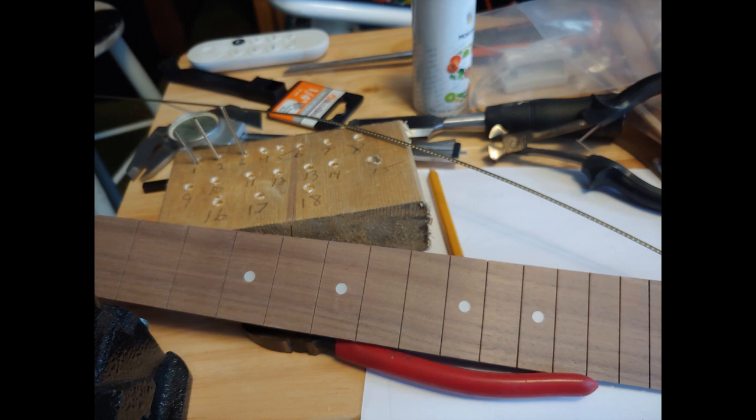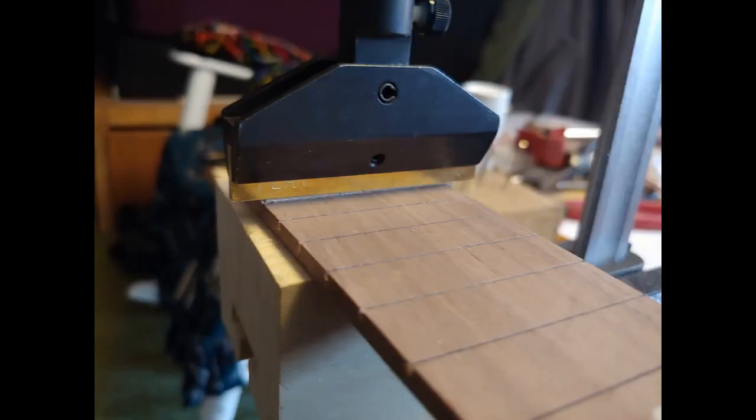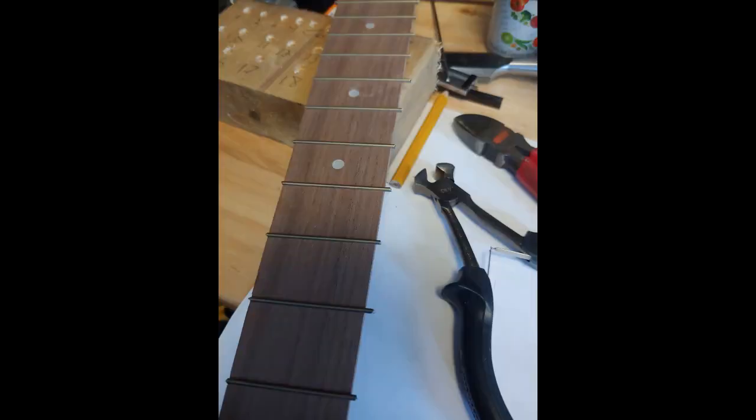There it is — all cleaned up, nice and flush and square, slots cleaned. You can see where I cut the frets inside the block and I basically tap them in with a hammer. I have a little hammer with a piece of leather, and then I use a fret press to get the fret in nice and even across the board. That way you'll have less fret leveling and sanding later on. When I used to just use a hammer I had quite a bit of fret leveling to do. I use end snips to cut them off, then file it nice and smooth.